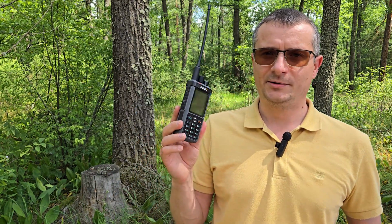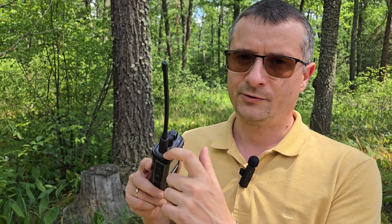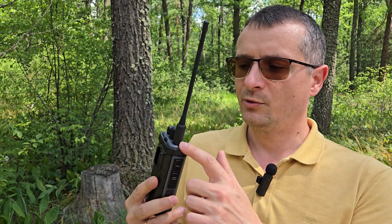Regarding the Xband repeater, it is available in this radio, but when the citizen band is disabled, you should switch between these functionalities. And for citizen band, you should use the separate antenna connecting to this port where the main antenna is located for VHF and UHF. But I would like to see for citizen band maybe additional port. But in this radio we have only 1 port for transmitting. But anyway, this radio works pretty good. Don't forget to buy additional citizen band antenna.